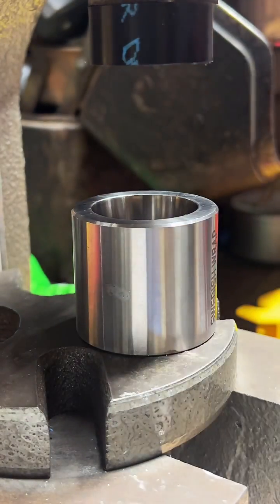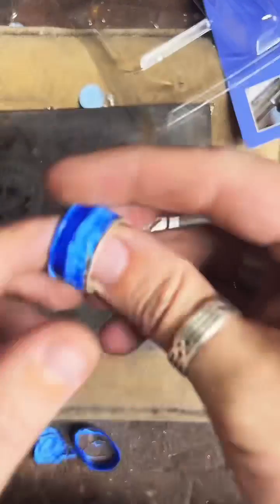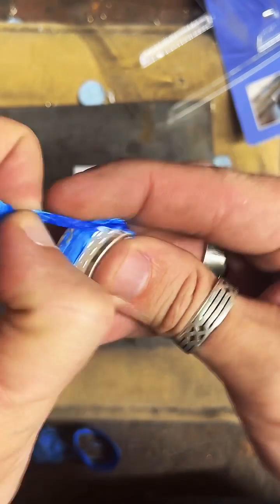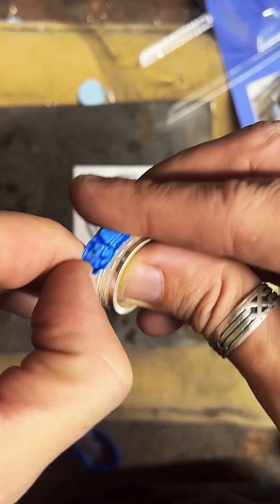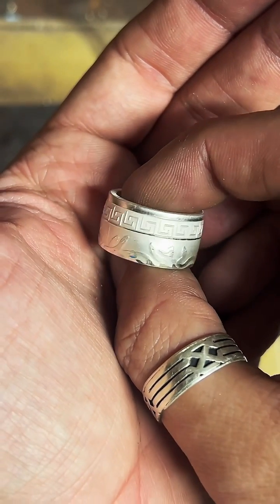Gold felt a lot like copper clad, like regular quarters. It has a really scary melting point though. If you're heating up gold, it pretty much goes from solid to liquid instantly. So if you overheat it, it's too late. It's toast. You have to be really careful annealing gold so you don't melt it. Copper is a lot more forgiving. You can get copper red hot and it's still not going to melt. But gold you have to be a little more careful with.